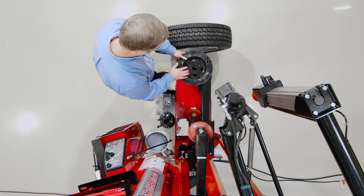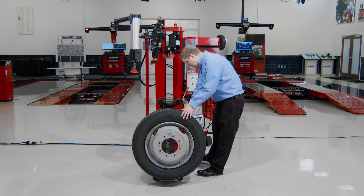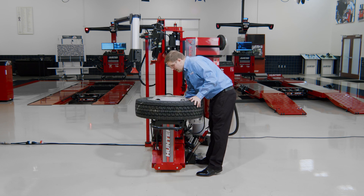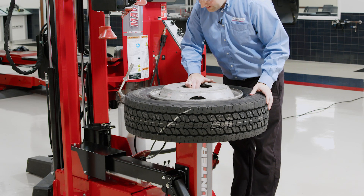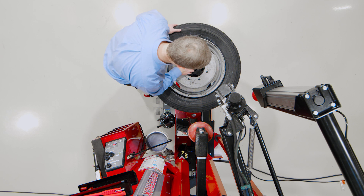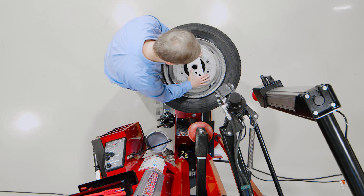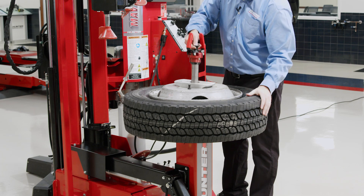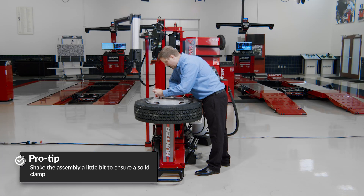I land my traction pin up here with the hole in the 19.5 plate. I use my wheel lift again to lift this really heavy assembly up into place, kind of lining everything up by hand. I've got a traction pin that I have to install between the wheel and the adapter plate. Then an aluminum cone goes down on top, clamping against the wheel — this is what sandwiches everything together. I give it just a little bit of a shake to make sure everything stays centered while I'm cinching it down. From here on out, the changing process is much the same.